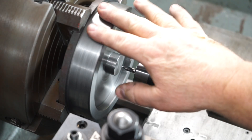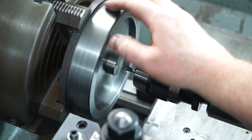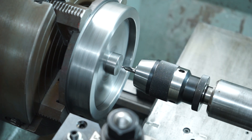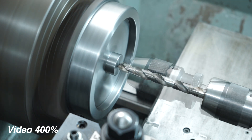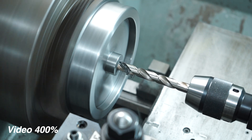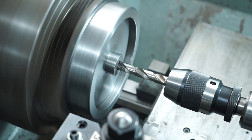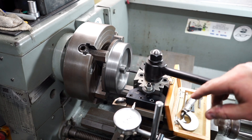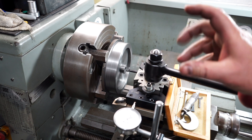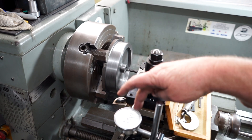Off camera I gave the flywheel a bit of a tidy-up — hit it with my lathe file, put a radius on here and here, gave it a little linen burnish, and a wipe down with WD-40. I'm going to drill it now — centre drill and drill — and then I'll ream that 15mm hole. I've decided against reaming though, as my crankshaft is measuring 14.95–14.96mm, so reaming would be a little bit sloppy.